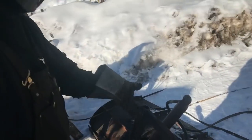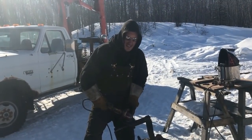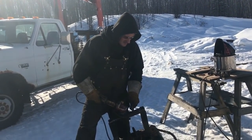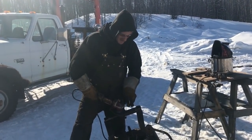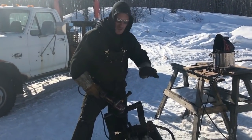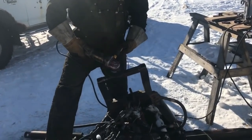Find good metal. Splice from there. And the trick is usually cut as close as you can to the base metal, but don't try to get too close because you don't want to nick it. So you're going to have a fine line between more cutting or grinding. This is only up about 3/16, it's not bad.